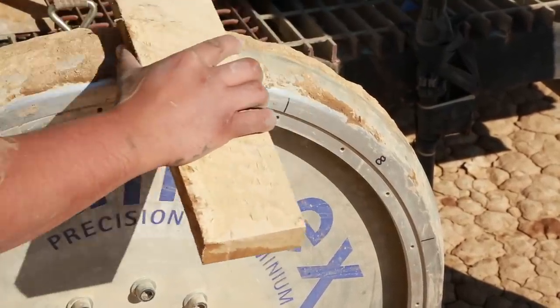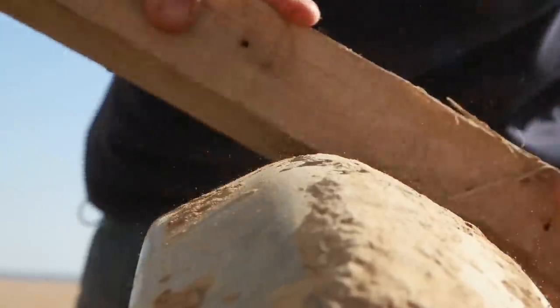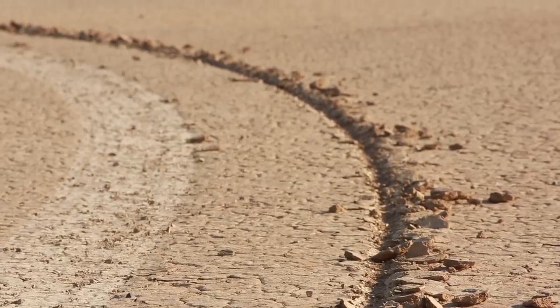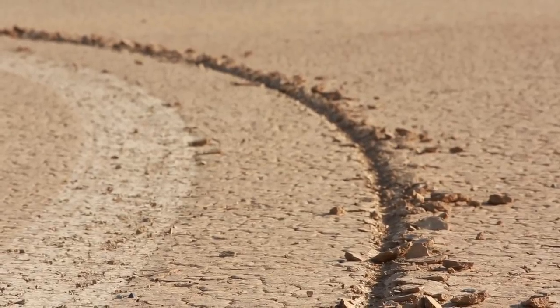With the wheel shape, we actually designed the wheel just like the inside of a jet engine. And the wheel shape we came up with, working with Ron Ayres, his view was we needed it to be a bit like a boat hull. So he thought the wheel would come up on the plane. So we had a V-shaped wheel profile. The first time we tested that in South Africa, towards the end of 2012, as it ran on the desert, that sharp V actually cut through the surface of the desert and got really damaged.